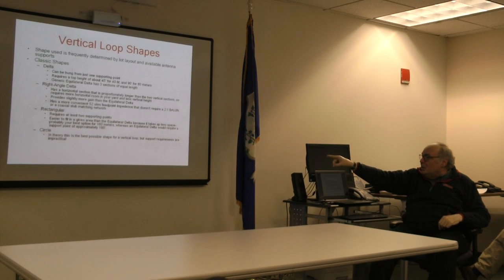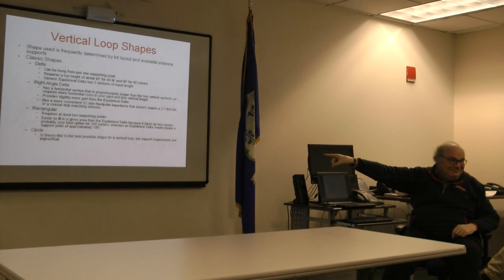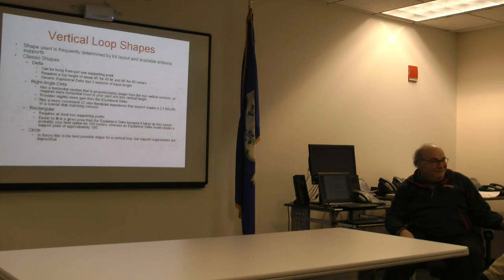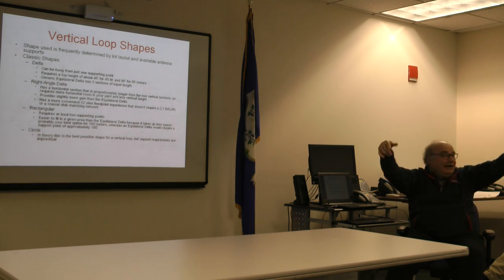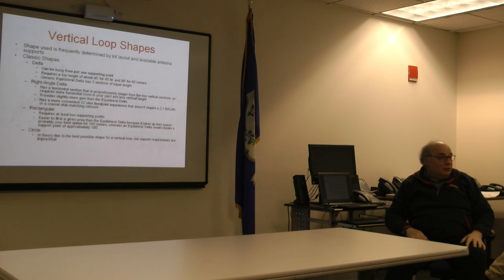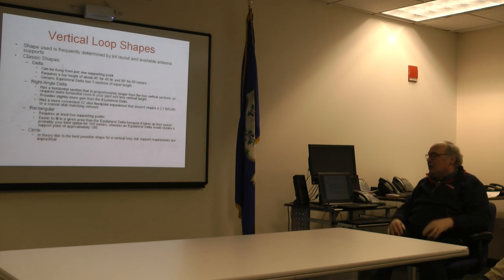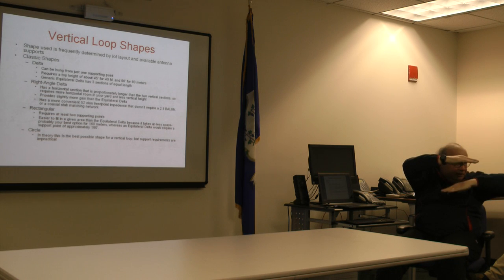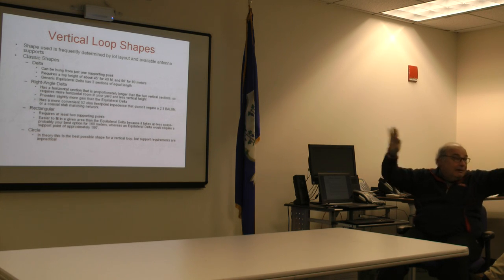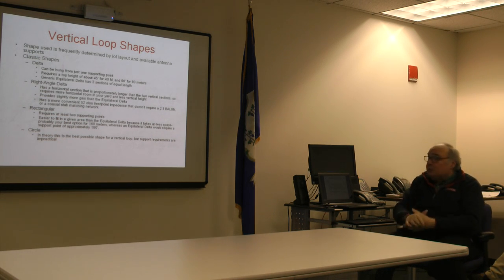Let's get back to 160. On 160, we're going to string a loop that's 550 feet on its outer circumference. How are we going to do that? If you've got a big piece of property with a couple oak trees separated by maybe 200-foot runs, it gets surprisingly easy, interestingly enough. The trick is to just get the run going horizontally to take up most of the space, right? And then complement it with trying to get a vertical run of at least 65 to 70 feet at both ends. And it will work surprisingly well for you.